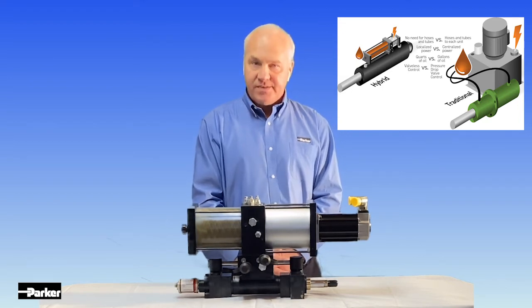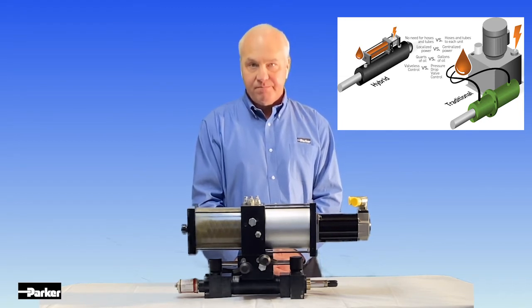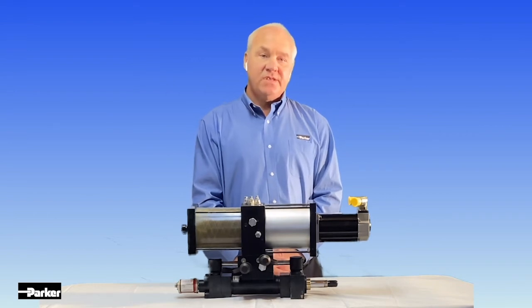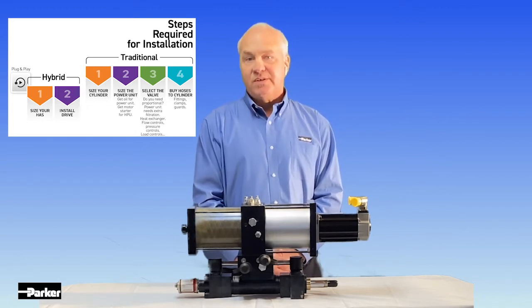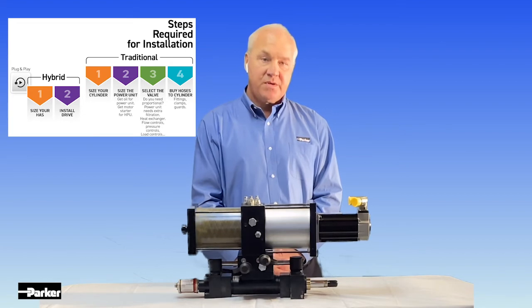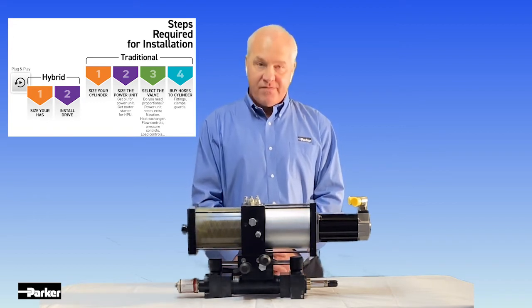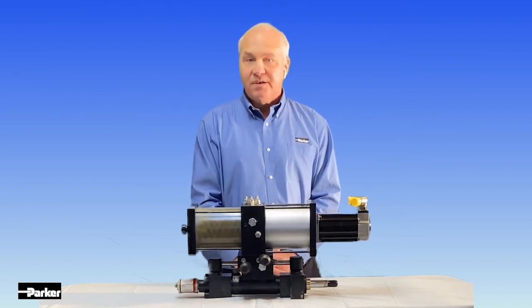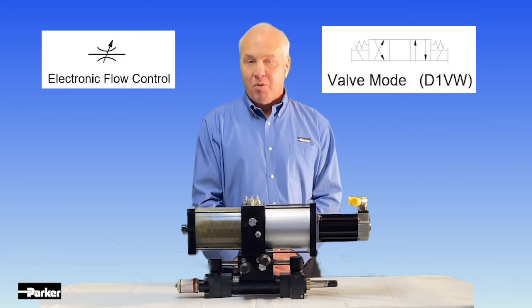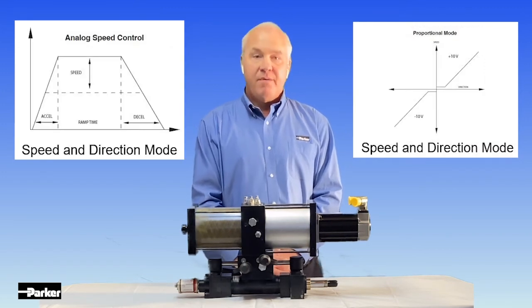If we wish to limit thrust, we control the torque that we put into the pump to limit our actuator thrust. Another feature of the HAAS unit is the simplicity — it is a simple two-step process. With our online sizing tool, you size your actuator and optimize the electric motor to meet your needs. Then you simply install the actuator and use our drive kits, which have valve-type macros. Common hydraulic functions have been duplicated in our drive kits, such as simple bang-bang directional control, soft shift, a two-speed macro, as well as proportional and servo-type macros.